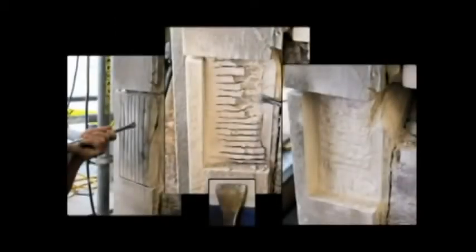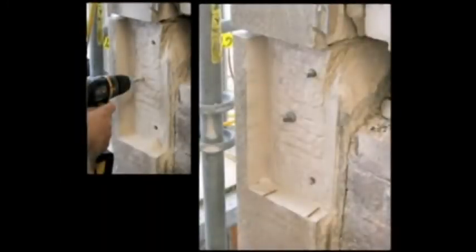In this sequence of photos, the removal of the stone is done with a pneumatic chisel, with great care given not to chip or spall the surrounding stone areas. The final cutting is done with a tooth chisel to increase surface bonding of the natural hydraulic lime, which is the material used to increase the strength of the Dutchman repair once placed.